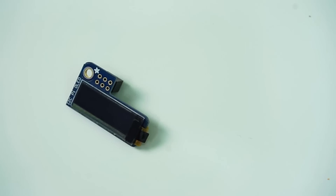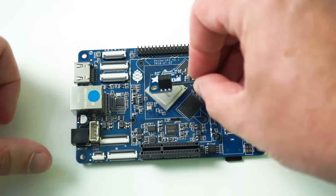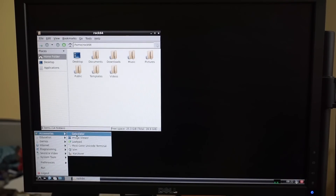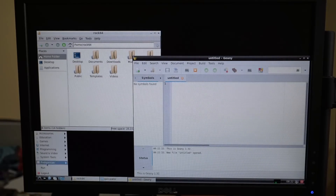Some drivers are missing in some distributions, and that puts you on difficult footing — sometimes one thing works in one distribution and another thing works in another, but there isn't one that gives you both. For example, I took my Adafruit Pi OLED mini display and thought I could put it on the GPIO pins, but the kernel I was running didn't have I2C support. Even after trying different variations, when I did get I2C working it didn't detect the board. From an ecosystem point of view, this isn't plug-and-play compatible with the Raspberry Pi, and you end up fighting with the software just to do something you could do on other boards very simply.